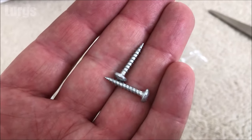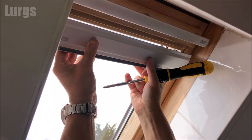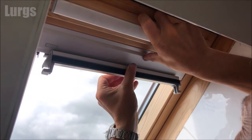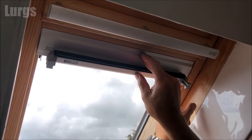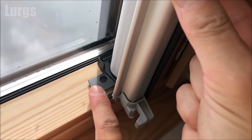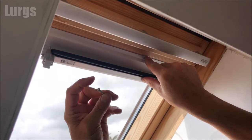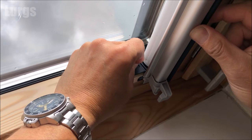Take two of the supplied screws. Offer the unit back up onto those brackets, then pull out the bottom roller blind unit — it literally just flips out towards you. You must do this to get access to the small black bracket where you're going to screw it into the hardwood on the side of the Velux frame. There is the hole, and you've got exactly the same one on the other side. I'm going to offer the screw in and just turn it with my fingers to make a scratch so I know where the hole is going to be, then do exactly the same on the other side.